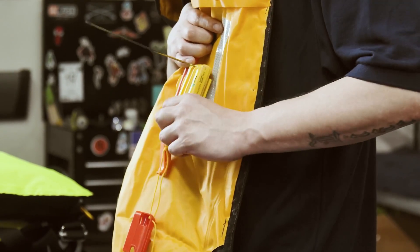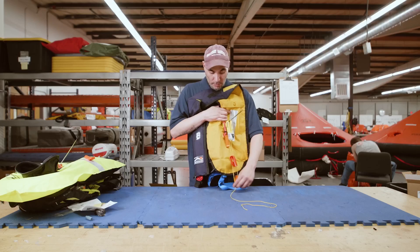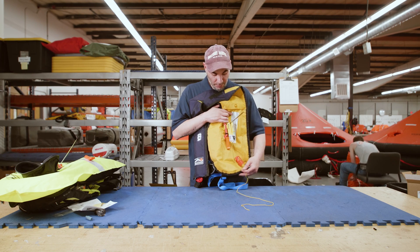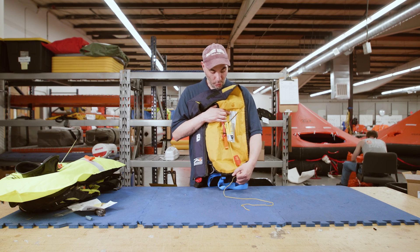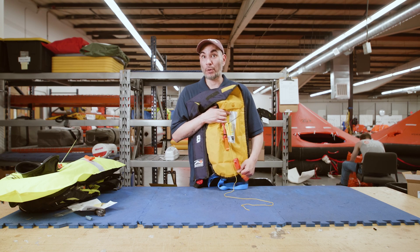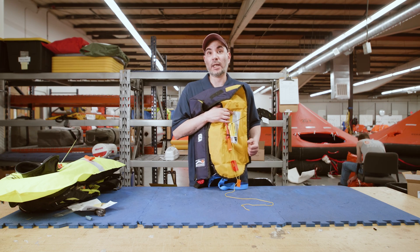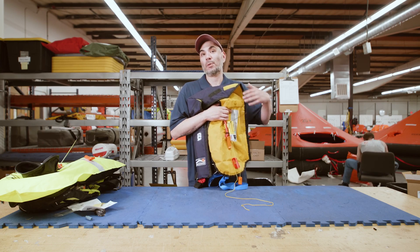Pay attention to the kind of AIS you have, how it's locked, how it's armed, and how it pulls. This one should go in there face first with the pull ready to go. Life jackets don't inflate at a super fast rate, so sometimes the lanyard set for auto pull, as the jacket is inflating, will kick it to the left or right and you won't get enough tension to auto pull. So be ready to manually pull it no matter how it's set, or set it for manual deployment only. I hope this gives you the top tips on the Kannad slash McMurdo.